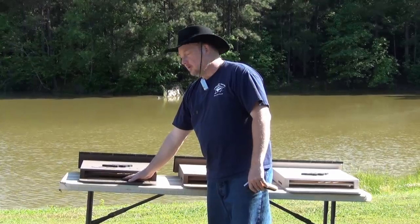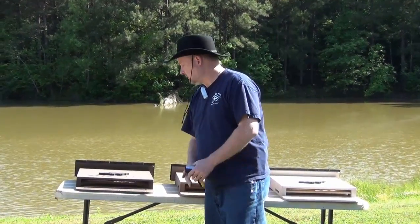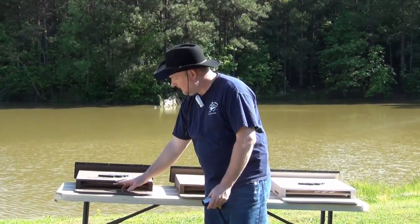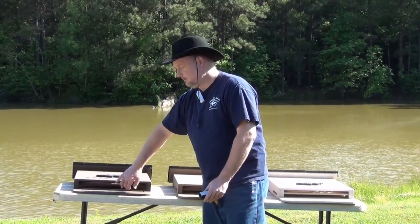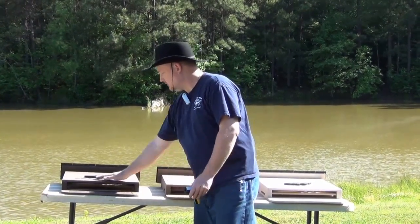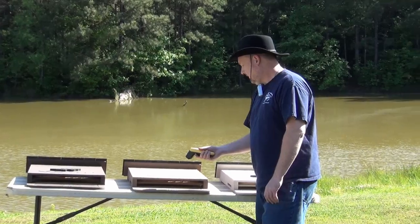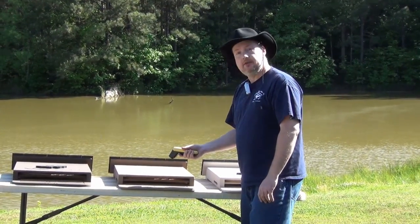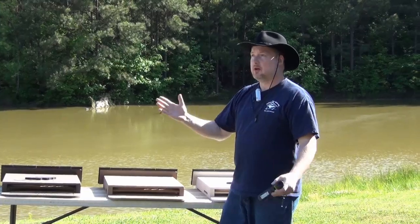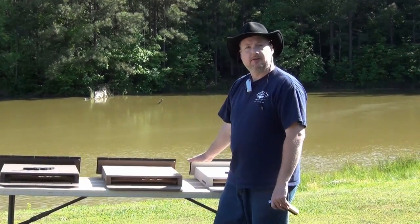Up in the north, the radiant heat will heat it up faster. You've got a lower ambient temperature because you're further north, so you're going to rely on the radiant heat to heat this house. Now surface temperature — because these have only been out here for about an hour, so the heat hasn't completely transferred through this plywood. On the surface of this bat house we have about 103 to 104 degrees right now. The surface radiant temperature of the medium brown is 98 degrees, which is perfect. So by taking these moderate days, when we're not competing with the ambient temperature of the air and we're looking at the radiant temperature, we can judge how these bat houses are going to perform.